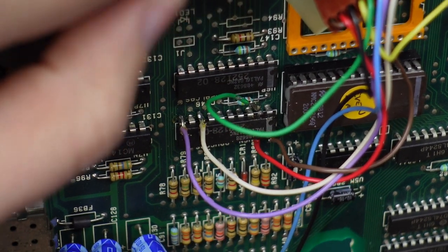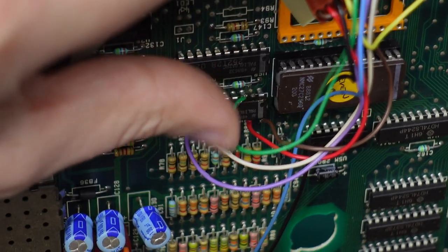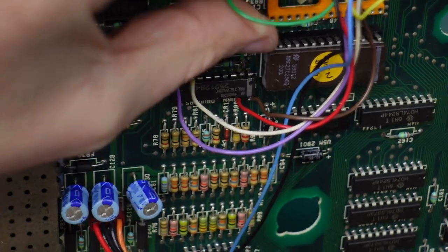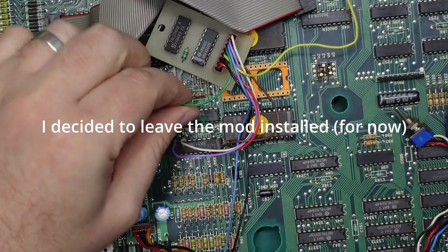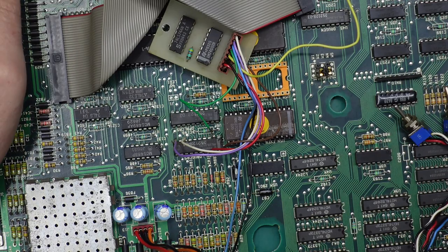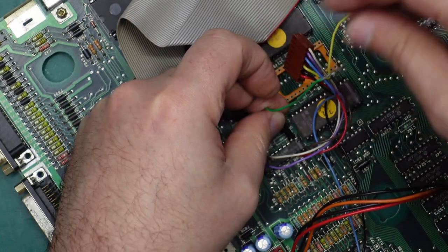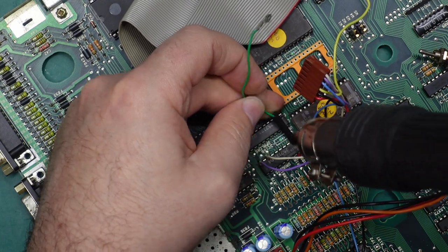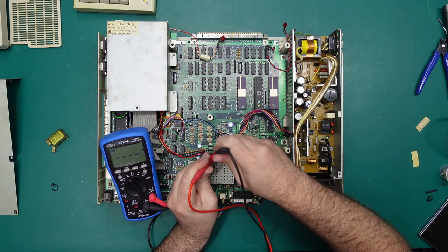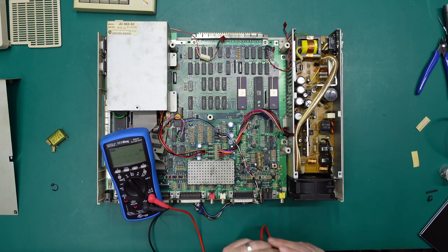It turns out the little green wire here is connecting directly to the board where a pin would have gone but has been cut off. You can see just how much lead is left and it could easily short to this little axial capacitor there. I've reconnected the red wire - I'm going to stick a little bit of heat shrink over this just to prevent it from shorting out, which is probably a better idea. I'm quickly checking these voltage rails to make sure nothing is shorted - everything looks fine, it all just looks to be charging up various capacitors.